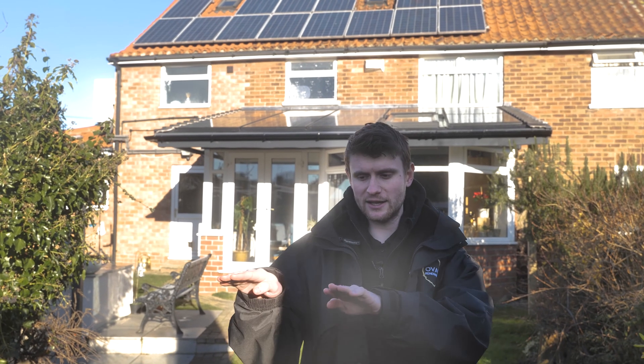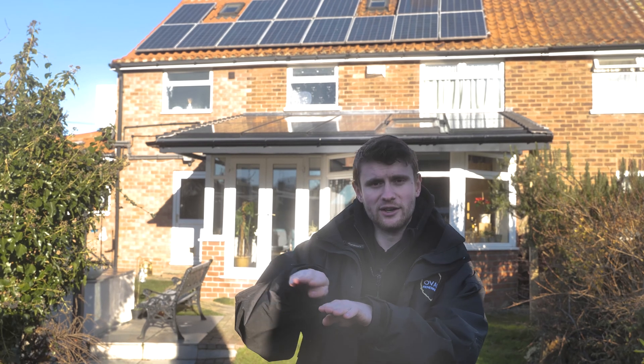Key thing with this: we've actually integrated this system with Velux as well. We've had the Velux flashings integrate directly with the Viridian flashings, which means we don't have to tile around the Velux and then fit the Velux flashings onto tile and then a bit of tile for the Viridian flashings — none of that. All the flashings merge together so there are no tiles on show; the only tiles on this job are around the sides and along the top. We've got the bottom flashing directly into the gutter.